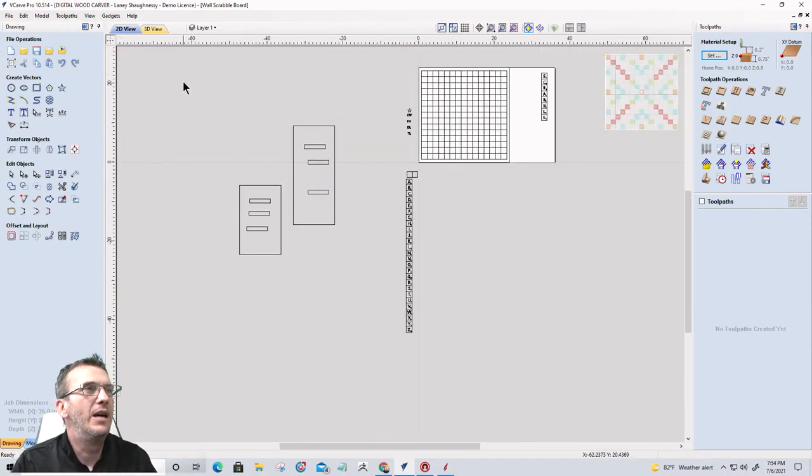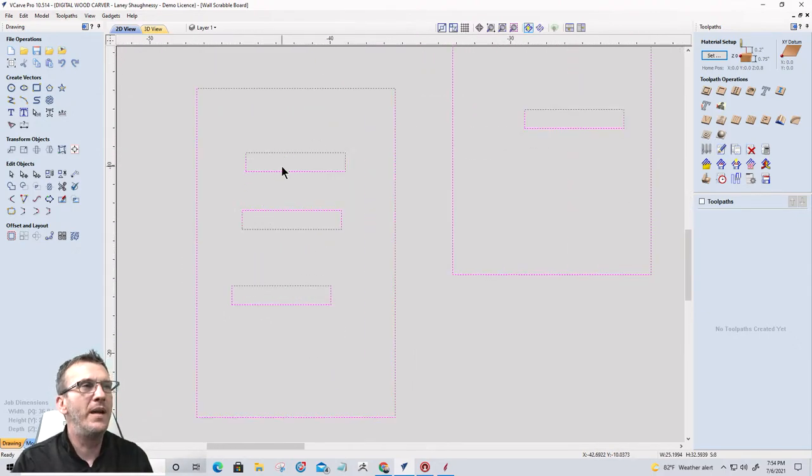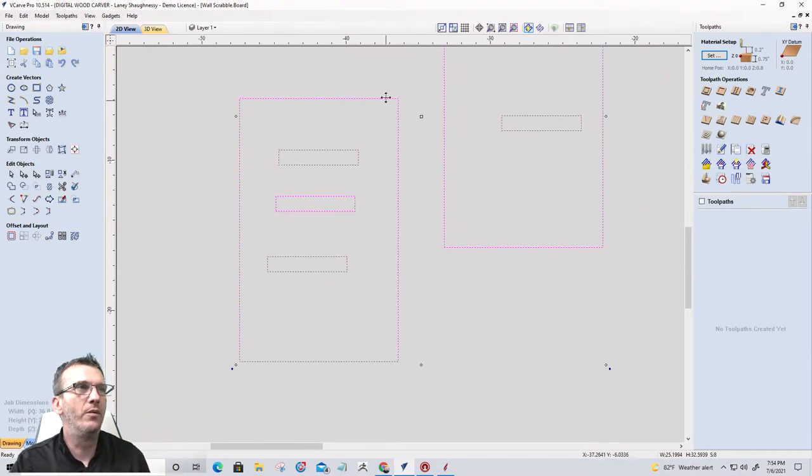And if I select this box now, let's say I wanna make my 1 inch mortise, I wanna make it 1.25 inches, right? So I'm expanding the width right here, okay? So it's 1 inch, I wanna go 1.25. So it's that height there that's relative, this height here that's relative. So if I'm at 1 inch tall, then I need to roll that decimal point over, and my height here needs to be relative to that, either 10 inches, 100 inches, 1,000 inches, that kind of thing.